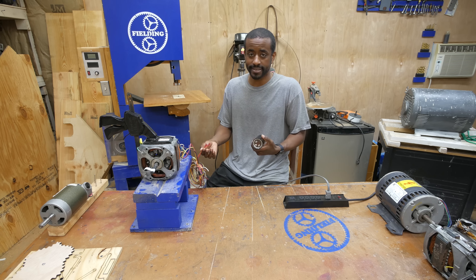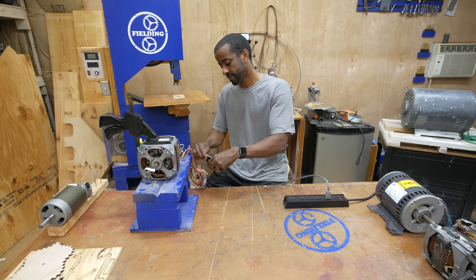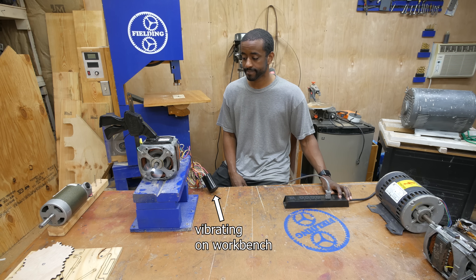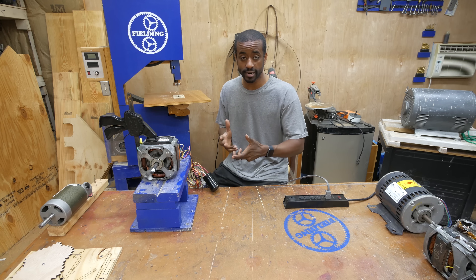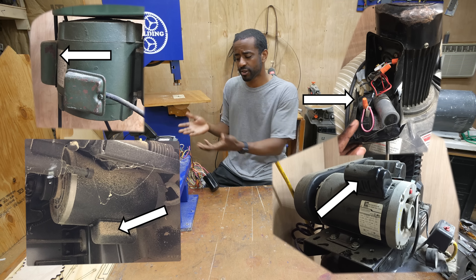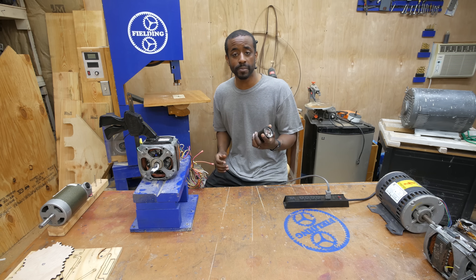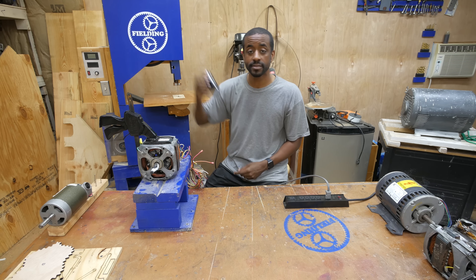In this case I disconnected it ahead of time, but if we go ahead and connect this working capacitor, the motor should start properly. Most power tools have a capacitor to help the motor get started — I'll put some pictures on screen so you can see where to find these. They're almost always connected directly to the motor, although in appliances the capacitor may be stored anywhere in the machine, sometimes way up at the top with a wire run down to the motor.